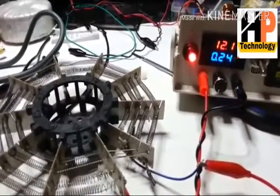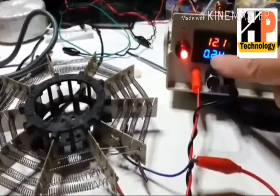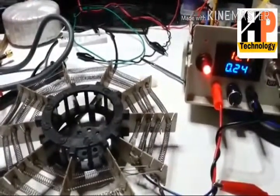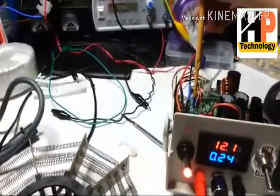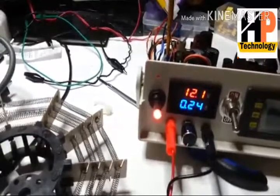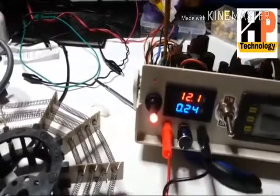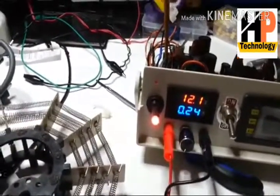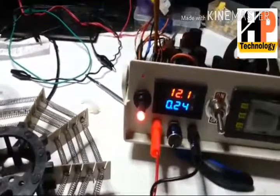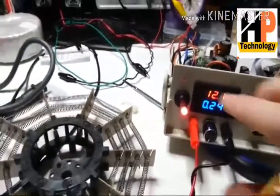So it does seem to be limited from on here. That's under the minimal voltage, and I did this already a couple of times. Did the twiddle of the amp in here in case there's any sort of restriction. But I'm telling you now, I've stripped both the ones that I've got of these, and it's not even connected to the board. I mean, it's in there, it's got holes and it's been put in there, but there's no tracks that lead into the rest of the circuit with this. So I don't expect it to do anything, and if it did, I would be very, very surprised.